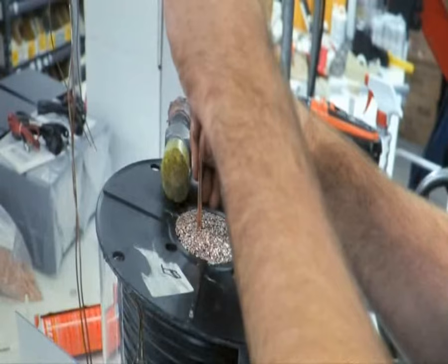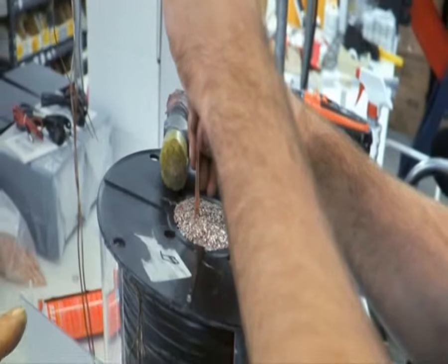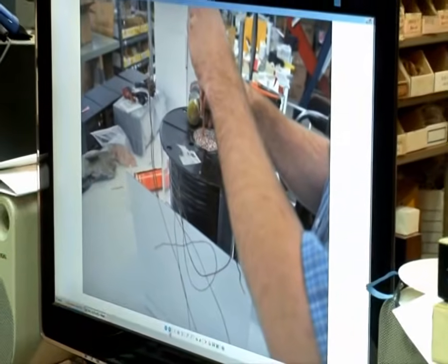And they're glued in the bottom where the coil's inset into the wood. Which particular coil is that? That's the biggest coil, in the center. Yeah, you can see it's the biggest coil because you have this plastic here. And you can see the metal shield's already on. It's already bonded, and you can see that it's not tuned yet, because it's not spread out.